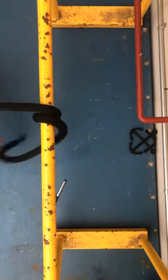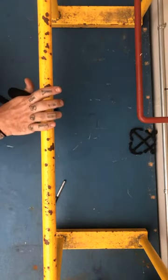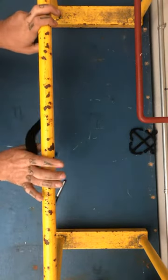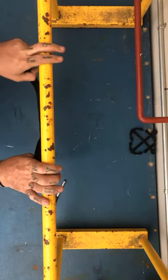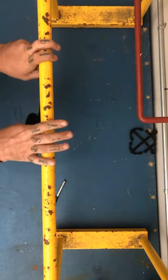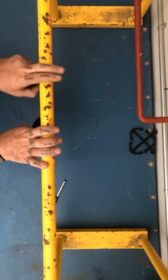Let's talk about a timber hitch. An important thing to remember: you don't want to use a timber hitch on a smooth surface — pipe, steel pipe, plastic pipe, acetylene bottles, things like that. It needs to be on something with a rough surface, preferably wood, logs. It's great for extracting logs out of the water. I'll just demonstrate on this, but know that it doesn't go on a slick surface.